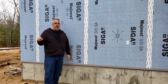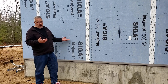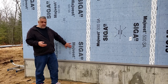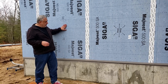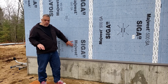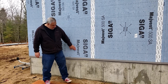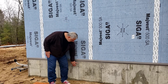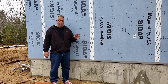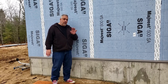We do it not only once but we do it twice. You've probably seen some of my videos where I show the double bead of sealant underneath the mud sill — I use the gravity of the house to seal all that up. It's a favorite detail of mine and we did that here. For those of you that want to argue about concrete being an air barrier, come over here, put your lips up against it, try and blow through it — you're not going to be able to.